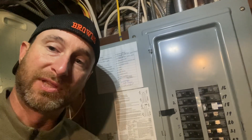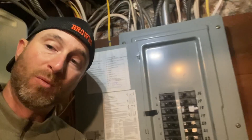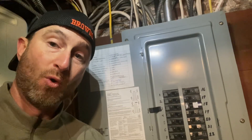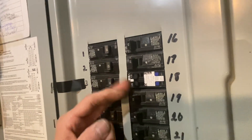David Bradley, Master Electrician here. Today I'm at an older home in Newburyport. You can tell that the electric panel was completely full, but we needed to add a new circuit. Instead of having to put in a sub panel or upgrade this panel to have more circuits in it, what I did is I put in a tandem arc fault breaker.